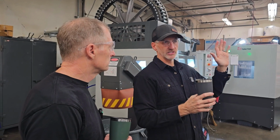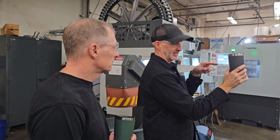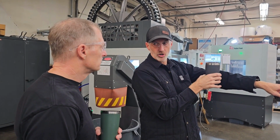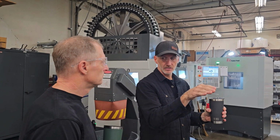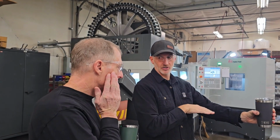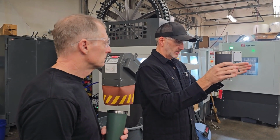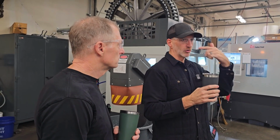just by the mere nature of having more than double the capacity in a tool holder on that one horizontal, because I had this 4th-axis capability, and it had a pallet swapper on it, just a single. So that ability to swap pallets out and get that new work inside the machine back to work, I can show a 16x in productivity by putting that part into that cell. We didn't have a pallet machine before. And we didn't have a horizontal 4-axis big tool changer. So all of those pieces stacked up, that one single standalone horizontal with a dual pallet on it would outproduce every one of our verticals combined.